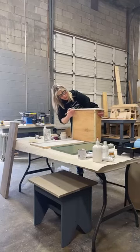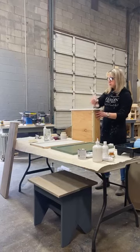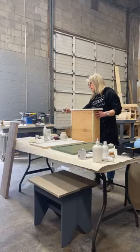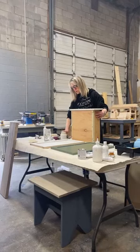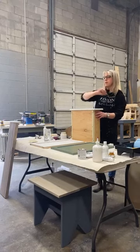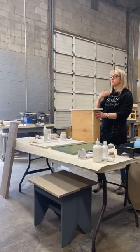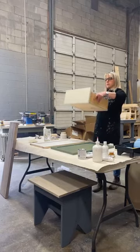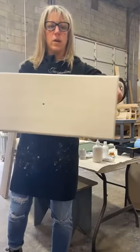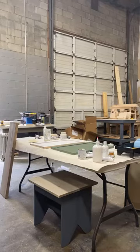If you're doing a big surface area, you almost want to segment it. For dining room tables with an insert, just do one side then the other. Do your edges, your top — and the bigger the strokes the better. That's just one thin coat, so you can see there are no drips on the edges.